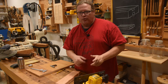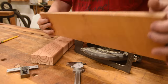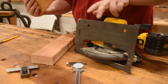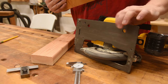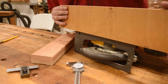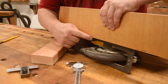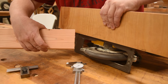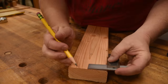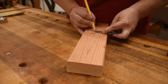Just make a jig for your tools so you can run them all through. I'm just going to use a scrap piece of plywood I found around my shop and the holes that are already in my circular saw. If you don't have holes, you can always install some. And just make a fence that allows me to cut a certain distance away from the edge to center cuts on the 2x4. To set the distance of that fence, I'm just going to find center on an extra piece